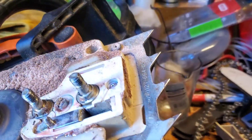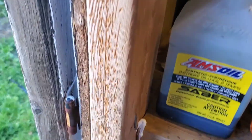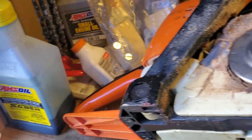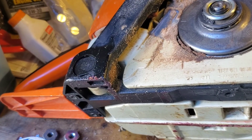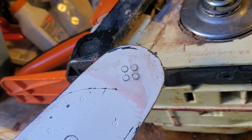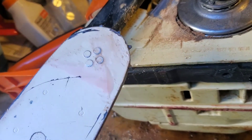What I did was I drizzled some oil into it and I ran it up and down on the wood like this to get it to roll. And it rolls, but it's got a couple of stiff spots in it. I'm probably looking for a definitive answer on whether or not the bar is toast. It runs good but I think there's a bog every once in a while and it might be related to this issue with the nose bar. And it's not a motor bog — it's a load bog.